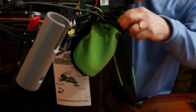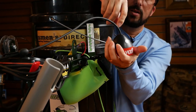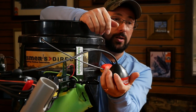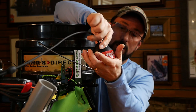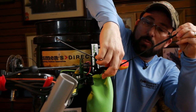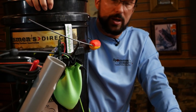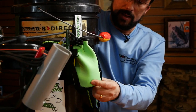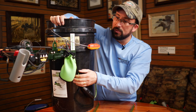Let's talk about the transducer holder. The weakest point on your transducer is right where the transducer cable goes down into the actual transducer. A lot of your failures, if you get one, are going to come right there. By using these koozies — and we've had different ways of holding transducers over the years — this is by far the best, most convenient, and safest way to keep your transducer safe. It holds the cable centered, keeps your transducer pretty vertical, and protects it from banging around and getting chipped or dinged.